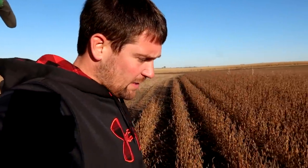These things are starting to shell out really easily — I'm getting some shattering at the head. These things are drying out, it's a warm day, the sun's been beating on them hard for a couple of days now and we've got enough of a breeze so they're getting dry. But the plants have really gotten brittle, so I've slowed the machine down and opened it up some to make it thresh a little bit easier and not be so aggressive on the beans. I'm going to check the job I'm doing back here — make sure I'm not leaving any on the ground with my new changes.